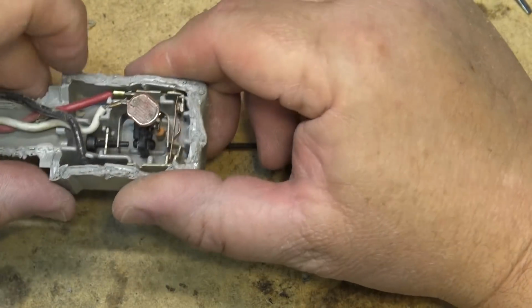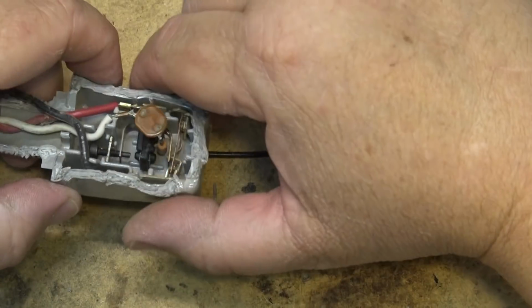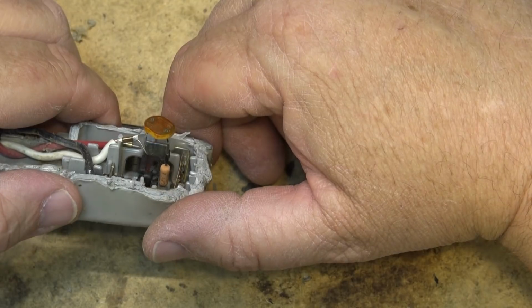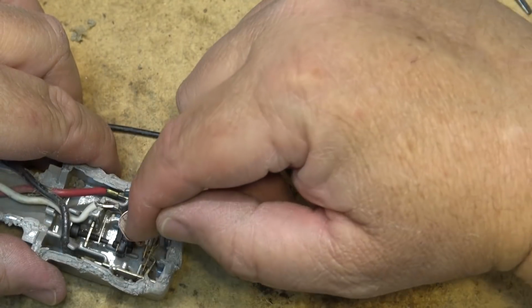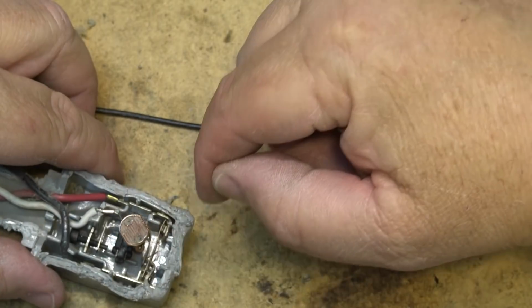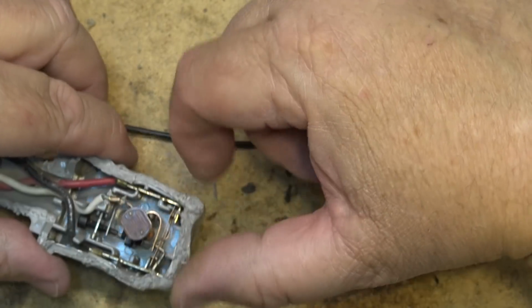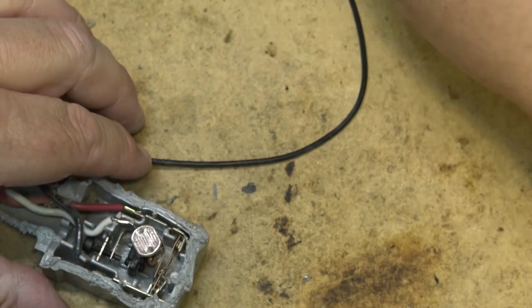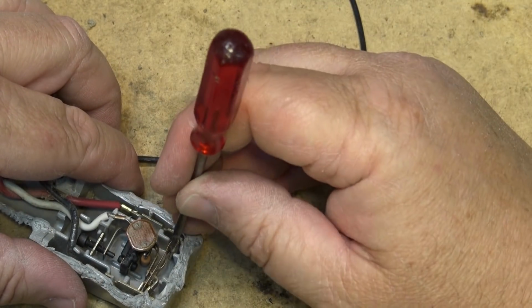photocells, these mechanical photocells, that you guys might like to look inside here and see what's in it. As you can see, there's not a lot, and there's not a lot to go wrong other than the photocell could fail or the resistor could fail, or the bimetallic strip itself, the switch here, could get damaged. I guess with inductive loads, in fact, that might have been what happened.